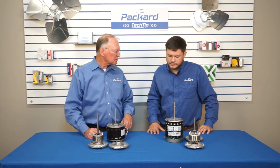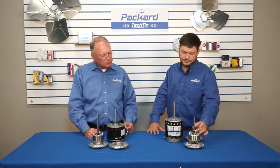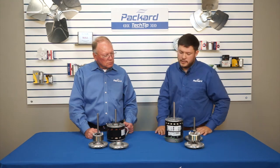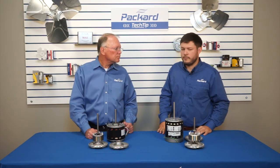Do you see that problem with ball bearings? You don't. Ball bearings are mounted a little differently — since they fit in the end plate so snugly, there's no chance for them to become misaligned. Dropping a ball bearing motor takes more to do damage to it, but if damage is done, there's really no fixing it.